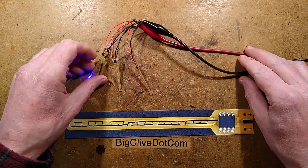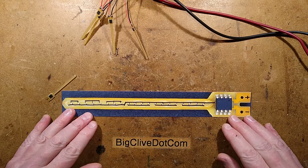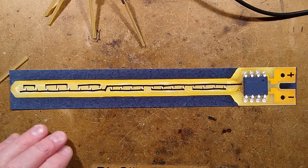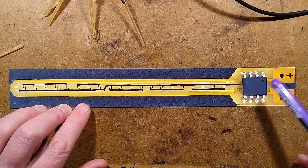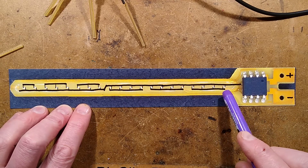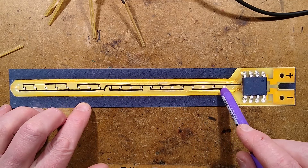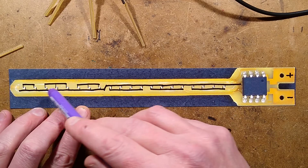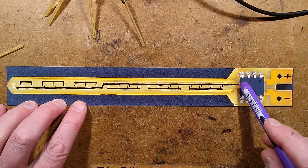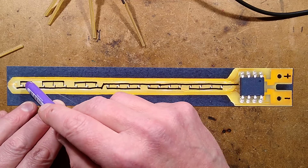Here is a picture of the circuit board. On the circuit board we have a little 8-pin microcontroller with the same pin-out as the classic PIC-12 type. It has 20 LEDs configured as groups of 4, 4, 4, 3, 3, and 2. I think that's so that as it flows down it ends in a brighter dot, because with 4 in series there will be inherent current limiting — making some dimmer, then slightly brighter, ending on a brighter note.